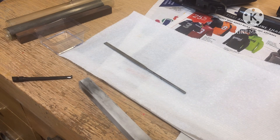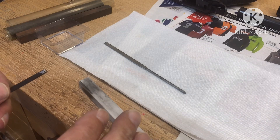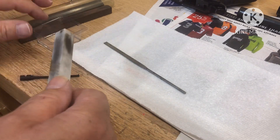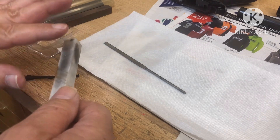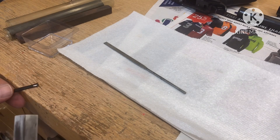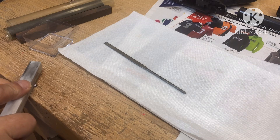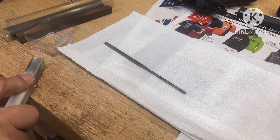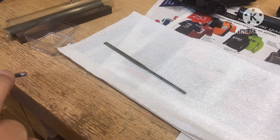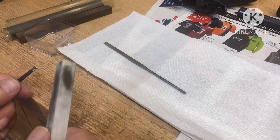On a ceramic stone you use water, not oil. I'm going to water the stone and try and clean it up and polish it with an extra fine stone, which is normally used for trigger jobs. I'm going to use a rolling motion and clean up that 45 on the underhook and the 45 on the flat on the side of the extractor at the same time, and just try and polish that up. You don't want to use a Dremel polishing tool because they're critical parts and Dremels have ruined more guns than anything else. This is easy — it only takes a few minutes and we're done.